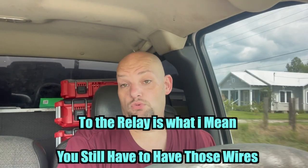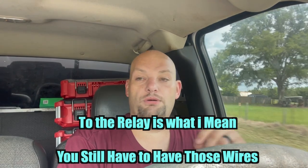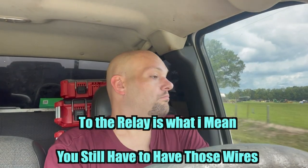But with the blower relay, with the brown relay, all you need is a common from the transformer and then your green wire. The common coming from the field connection is no longer needed. You don't need the hot one coming or none of that anymore. So you can eliminate some of those wires when you do it that way. But, you know, I like to keep it OEM. They're like 20 bucks. I keep two or three of them on the truck. Now that I know that I used one, next time I go to Johnstone, I'll pick up another one and replace it. But just the kind of guy I am.